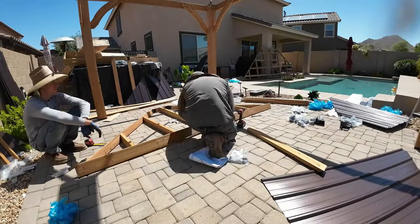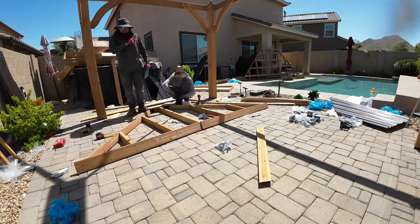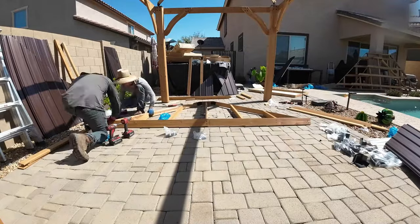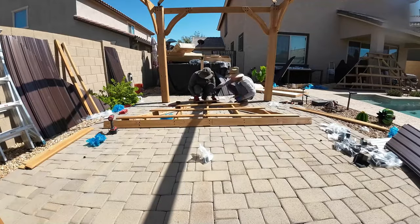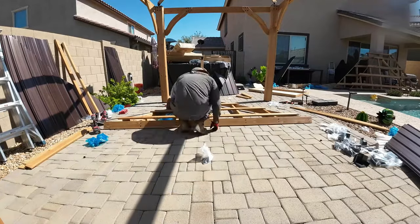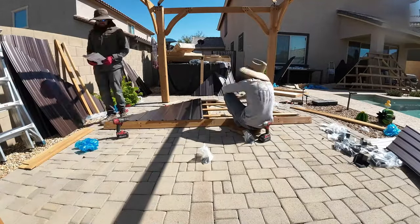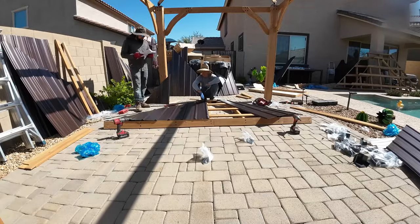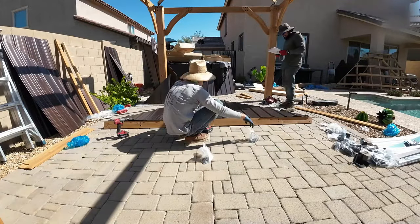We just put the frame together, and like I said, this is going to be the longest part of the job. Each panel will take you a long time — I'd say an hour to an hour and a half — because you've got to put the frame up. A lot of the wood is not going to be straight, but thankfully everything has holes. And this is extremely important: follow the pre-drilled holes. Do not make your own. You're going to be tempted to drill new holes because you think you're the master handyman who's been doing this for 55 years, but you need to follow the pre-drilled holes in the wood, even if the wood is bowed, because everything is laid out the way it's supposed to be.